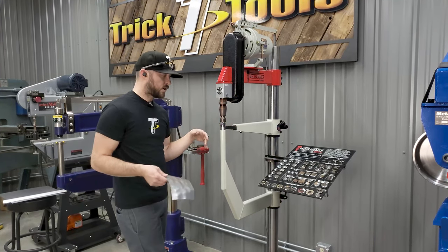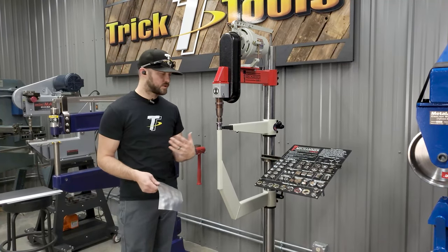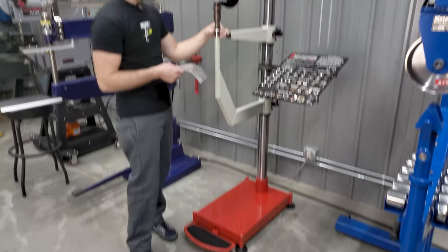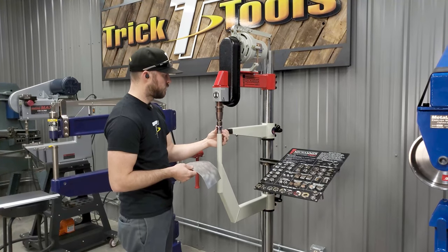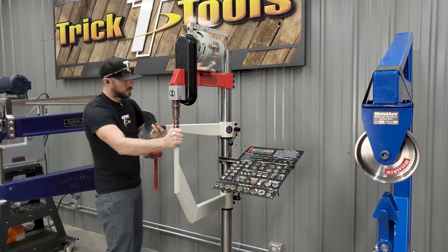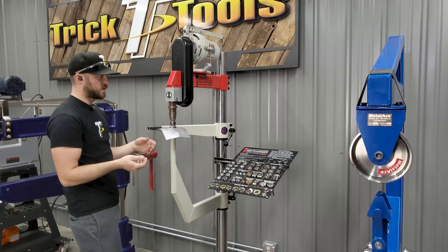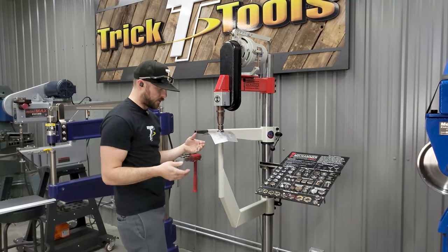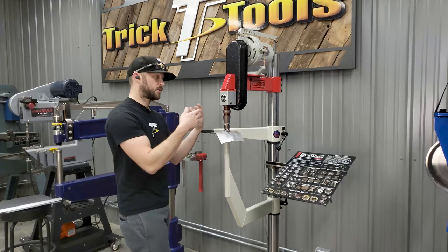Because of the way this hammer works, you're not actually applying the pressure to the die with your foot as opposed to how the ProLine works. There is a spring right here that keeps the down pressure on the dies, so that gap is always set. When you run your panel in here, the pressure is already set, and as you push on the foot pedal and it engages the motor it does the hammering based on how hard you're pushing — think of it like a gas pedal, the harder you push the faster and harder the hammering is working.